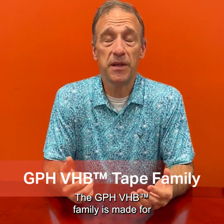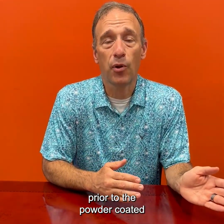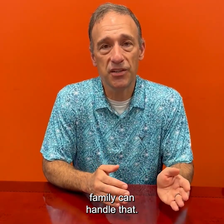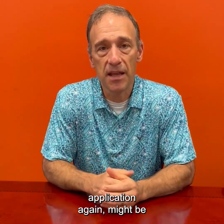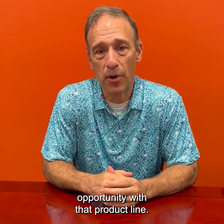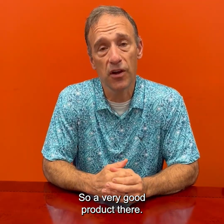The GPH VHB family is made for very high temperature applications like bonding metals prior to the powder coated paint oven process. That GPH family can handle that, plus high temperatures in use in application. Again, might be sort of a niche, but a great opportunity with that product line. And it is similar to 4941 in terms of performance, so a very good product there.